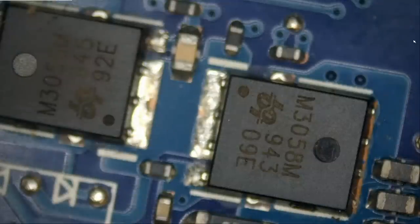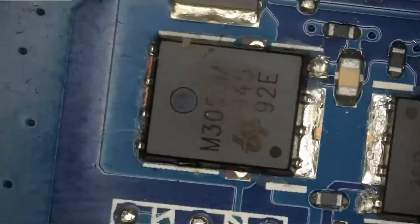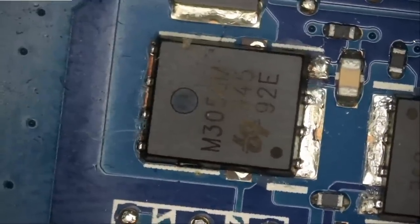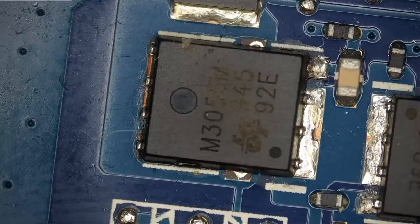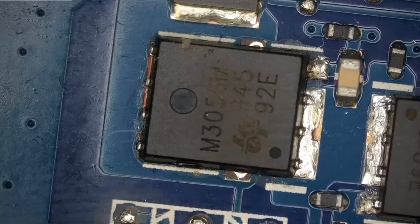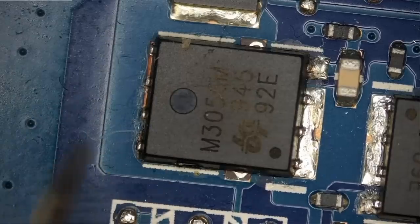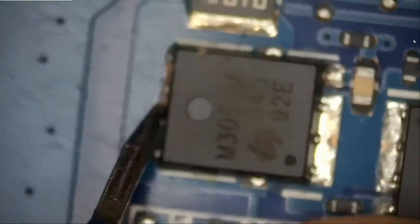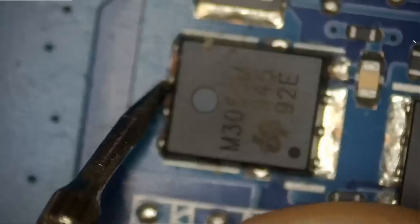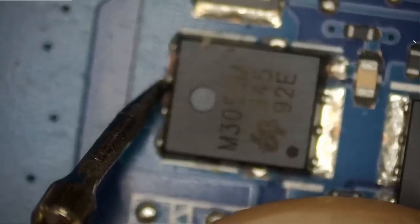What do we do in this case? We do like we've always done — we're going to inject voltage. Let me connect my ground probe. We're going to inject voltage at the drain of the second MOSFET and then monitor the board under a thermal camera and see what gets hot. So if we inject voltage on the drain — I'm going to inject 1.2 volts — and right off the bat the voltage injection tool is drawing 2 amps. So something must be getting hot on the board.